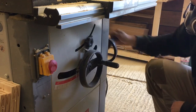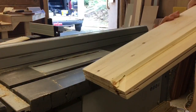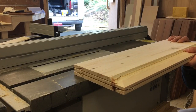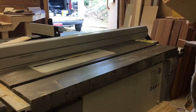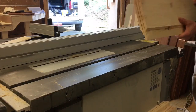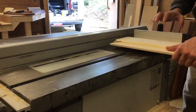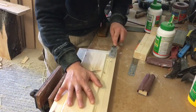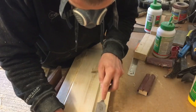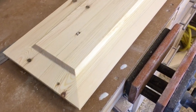Now that the first cut is finished on all 8 panels, I reset the blade and the fence for the second cut. That's the first piece done — the blade has left a little excess material in the corner, so I have to re-adjust the fence, but otherwise I'm happy with the result. The lines are very neat and sharp, and the surface, like I said, hardly needs any sanding.